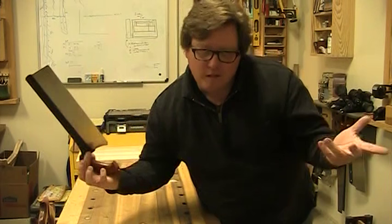To be accurate with your knife, the first pass just slightly kisses the wood making a slight indentation. The second pass is a little firmer, the third even firmer, and you can make subsequent passes as needed. You don't want the wedging action of the knife to move your square. That's why the first one just barely kisses it — and you want a finger bracing along the side so the square doesn't move over, giving you a nice straight line.